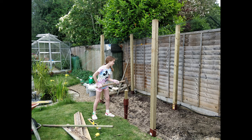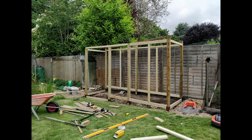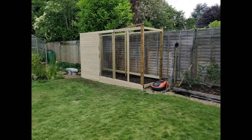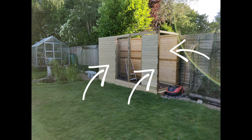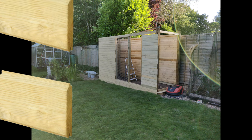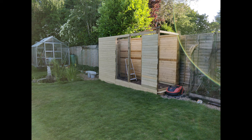For this first stage we're building the indoor zone. As this zone will gain a lot of structural rigidity from the solid roof and sides, we've chosen to use only 75mm square posts — or 3 inch square posts. With the posts set, we then fix the bottom bars and the top bars between the posts, ensuring the structure is straight and square. Then simply nail on the cladding. We've used weather resistant tongue and groove cladding, 19mm thick or three quarters of an inch, for additional solidity.